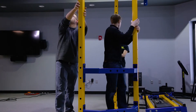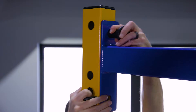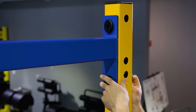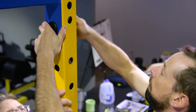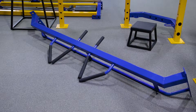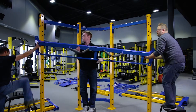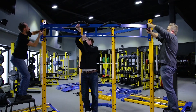Next, lift the right side storage crossmember into place and fasten with mating bolt. Attach the right main upright. Repeat this step on the left side of the unit. Finish off the main frame with the main double bar cross member. Two people will need to lift it into place while one person attaches it with mating bolts on each side.